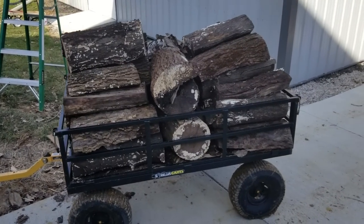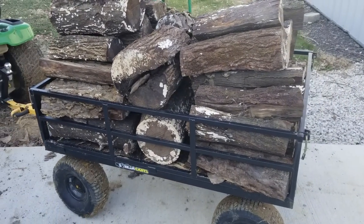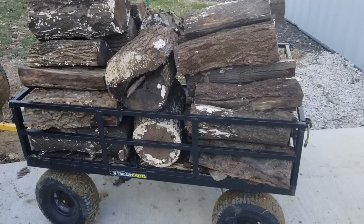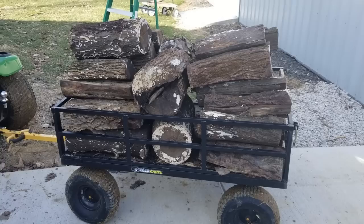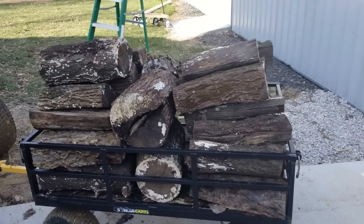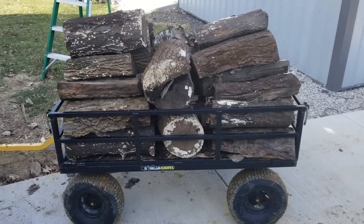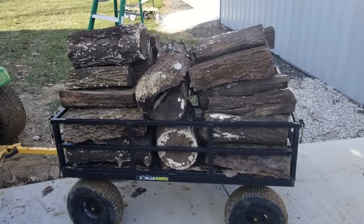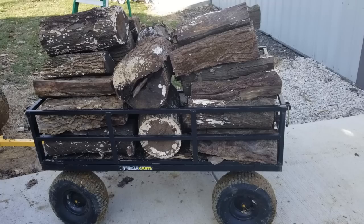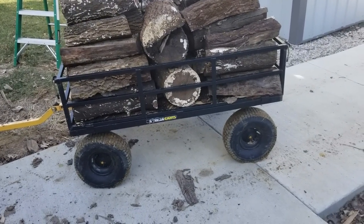All right. Here is the true comparison. This is my gorilla cart — I call it my wood wagon. It's the largest gorilla cart they make; I think its capacity is 1,400 pounds. When it comes to the 10,000, with temperatures in the upper thirties to low forties for highs and lower thirties to upper twenties for lows, this whole cart would last me two days. I would put this stack in in the morning and a little bit in the middle and that would give me close to 24 hours. The left stack I would load the next day and get close to another 24 hours — so two days per cart. But notice in my videos, each one of those stacks was getting me five to six days with the G200.